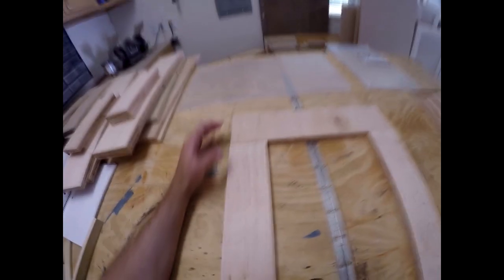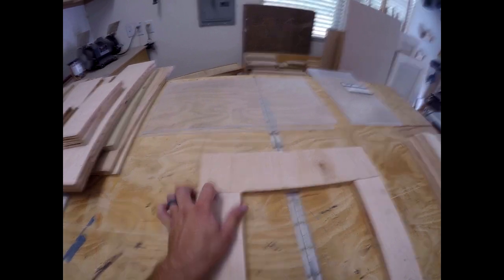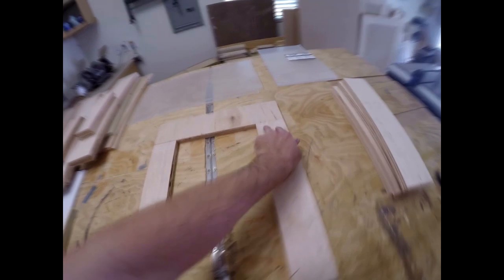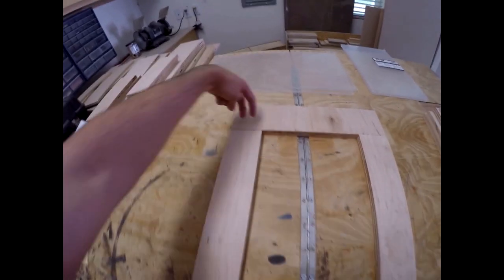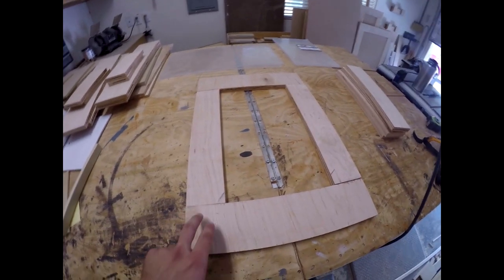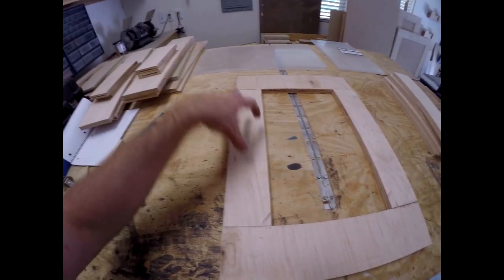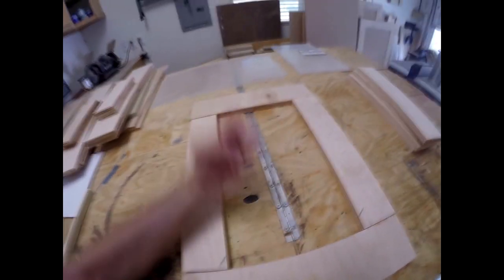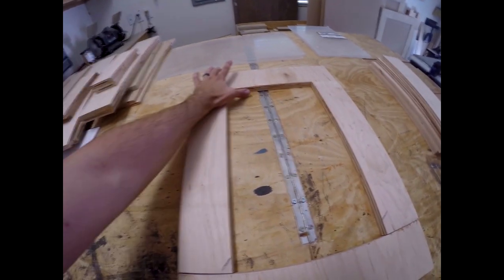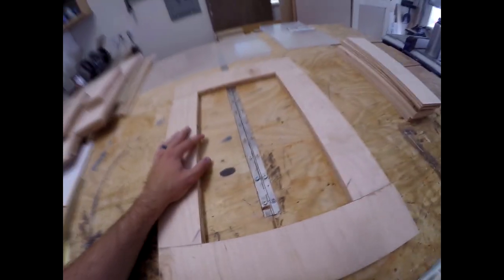When retaining this layout, the biscuits still line up because they're on the same plane. When I do my pocket holes, this can be the ugly side that no one sees. It's plywood, so you're going into end grain no matter what direction you go - it's just my preference to do pocket holes on the vertical style part. The thought process is: if you had two pocket holes going like this, I like the idea of taking this piece as the center as your core and pulling everything to the core rather than crushing it. Here's my core, here are the screws pulling it in, making a nice tight frame. I'll get going on the pocket holes.